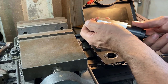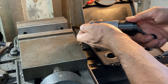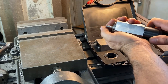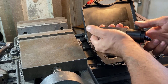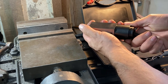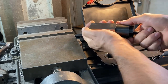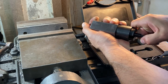And at some point, it's going to get to the point where it begins to tighten the collet. So we need to get our stick out correct. We're going to mill that much of a flat on there. And then we want to get it to where we have the closer tight enough on there that we can get some significant pressure when we close the lever. Because that lever is what's going to hold the thing from shifting while we're milling it. So you need some pressure on it.